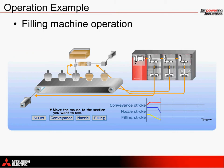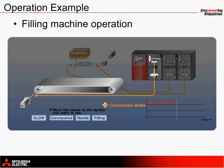Let's take a look at how each axis performs individually. The conveyor axis is plotted as distance or stroke length versus time, where the distance is set up via an electronic CAM. The CAM moves forward for a short period of time and then remains stationary during the rest of its stroke. After two periods of time, the CAM process repeats itself. This is known as a feed CAM.